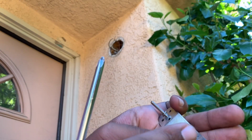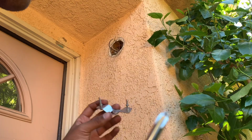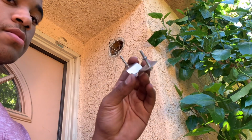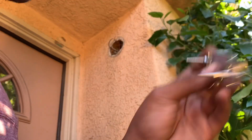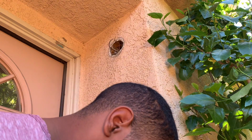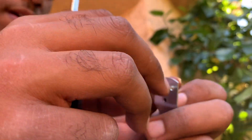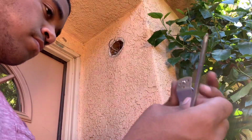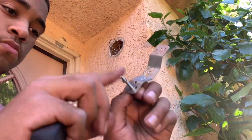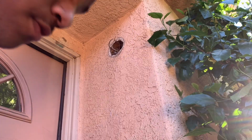The bracket screws' threads are really big. It's not going to make the light fixture sit flush, because this is designed to be bigger, and that's where you have to trim these. So I recommend removing these so you won't have any trouble putting your light fixture on the wall. You just need to take the bolt off the new bracket. And these bolts are removed.